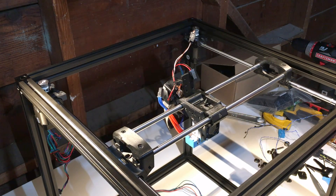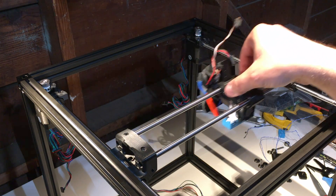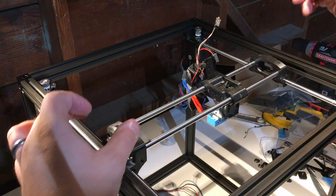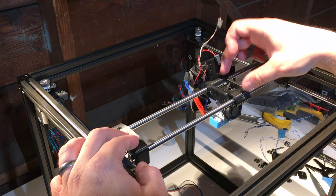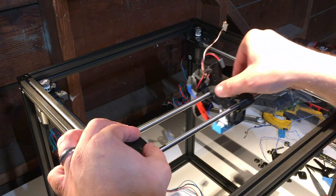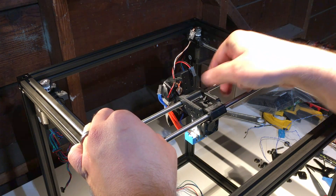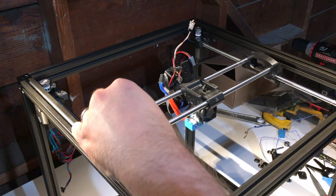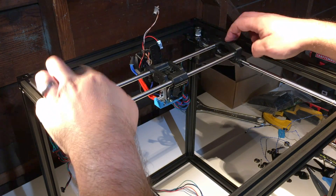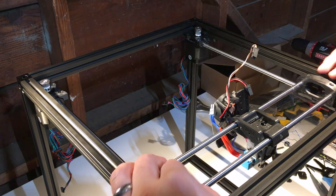All right, so it's on here. This might be a little tight right now — when we tighten these bolts it actually spreads this out and matches the distance set between these two bearings, so it's kind of crunchy and sticky right now. When we tighten these, they will find their place in life.